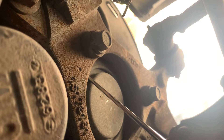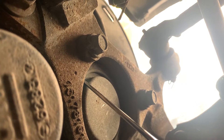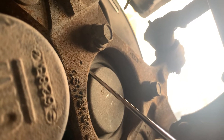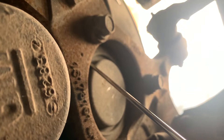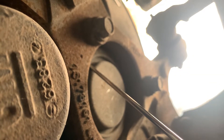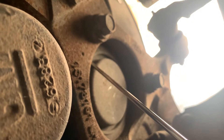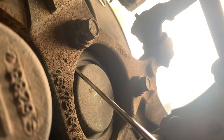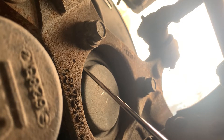When I listen, this one is fairly scratchy sounding. I've compared it to the one on the other side - the newer one I've changed - and that one is a lot less scratchy than this one. So I'm wondering if maybe all this time this one has actually been the source of my problems. This is also why you should change them in pairs - don't cheap out like I did. I'm going to try to get a recording by holding the stethoscope earpiece up to the mic on the phone. You just hold the probe on the back and give the wheel a spin.